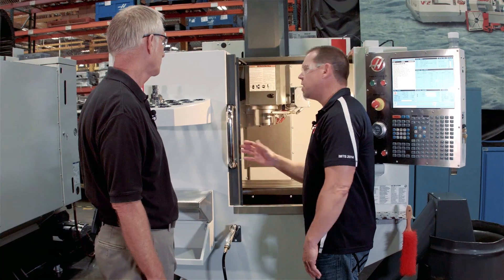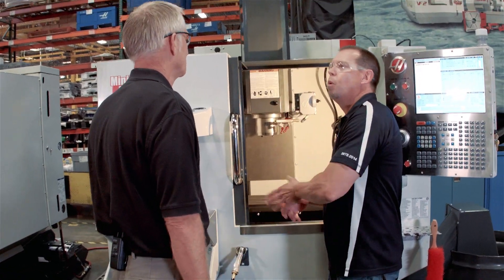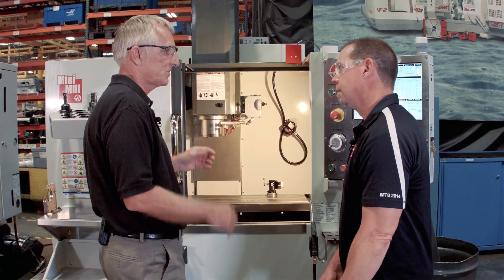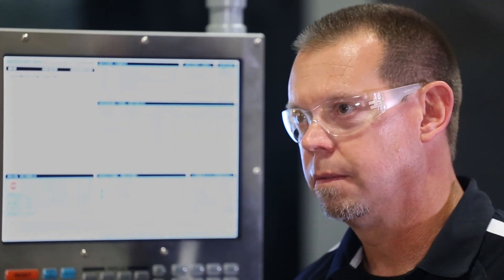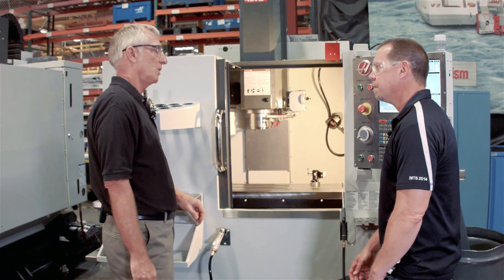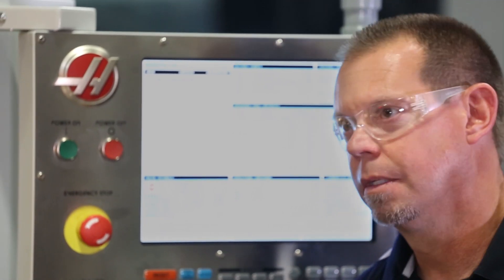The other thing that really stands out when I walk up is — wow, this thing's got a roof now. It used to be the Mini Mill was totally open, and now you've put a fully enclosed sheet metal roof on it. When we first started out with the Mini Mill, we didn't think we needed a roof, but as we've added TSC and lots more coolant, we had the clear plastic top but it still had openings. So we fully enclosed it just to keep everything in there. And if you're going to fully enclose it, now you need light — you don't have the light from your shop anymore. So we added the brightest LED we could find, and it actually lights it up better than with the roof open.